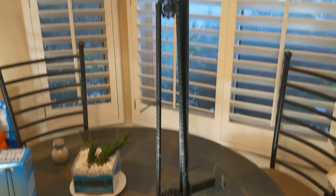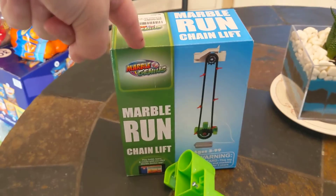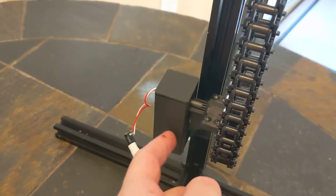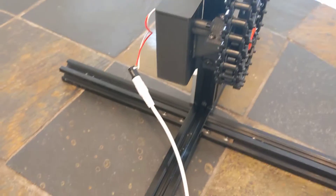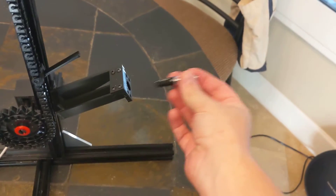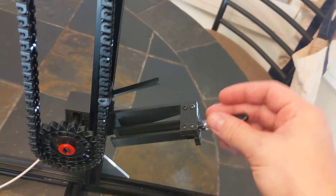Here is the cart elevator. Basically it's the guts from a marble run chain lift. I took the motor out of the housing, 3D printed a new custom motor mount that fits it really nice and snug, then another upper axle here, and mounted it on this temporary cross stand and got it all tightened up. The idea is that cartridges get funneled in from the chute, which comes out of the conveyor belt, they come into here and slide into this thing.